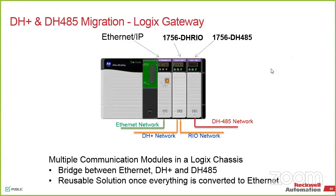Take it away, Mike. Okay, communications migrations. Basically, if you're using a Blue Hose or a proprietary network, we're telling you to get off of it. We say it nicely, but it's time to get rid of Blue Hose, please. Mainly because all the people who know how to support it are not with us anymore. And the only thing I'd say, if your Blue Hose network doesn't work, you're missing a resistor. I find that's the answer 90% of the time. That's why I'm the network specialist here.